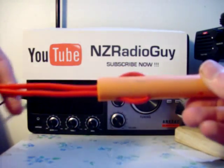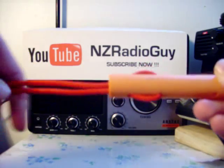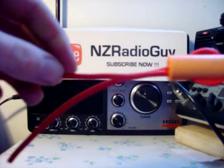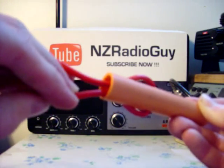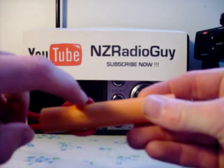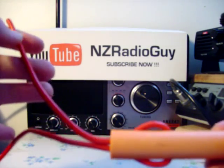I'm using here a 12 gauge electrical cable as my antenna. This is my main element. It comes along, gets fed into the center of the insulator, comes out a hole, in another hole, out the top, down again and comes out to the end which I can then cut and tune my antenna by.